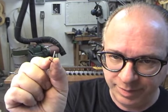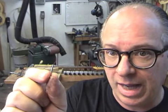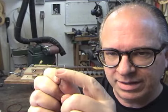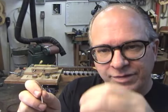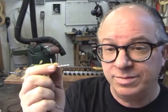Now that we've got the fret slots all cut to the right depth, we want to chamfer the top edge of the fret slot a little bit. When they make fret wire — here's a little piece of what I'm going to be putting on there — they shoot it through a die, which is called extruded. And so this little T part where the tang meets the top is not a perfectly right angle; there's a little bit more material in there. So we want to relieve just the inside of the slot at the top, so this thing will sit hard on the fingerboard all the way down on the rosewood. That just makes the guitar sing.